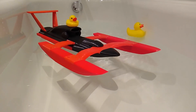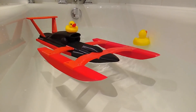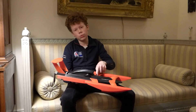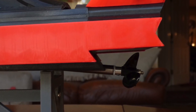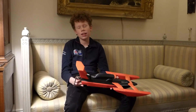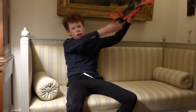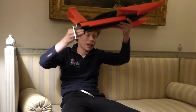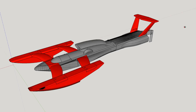I forgot to video what happened because it only had one brief run and didn't exactly go to plan. The problem is that the motor in here is really powerful, and because we placed the propeller under the boat, when we accelerate it sucks all the water out from under it. This then means the boat collapses into the hole it's dug, then launches itself out of the hole, lands back on the water, and does the cycle again. It kangaroos around, really. Back to the drawing board again.